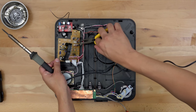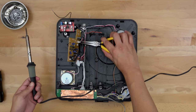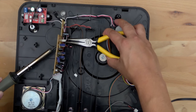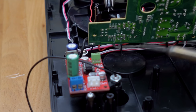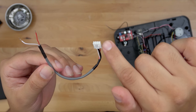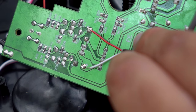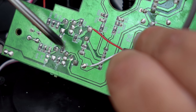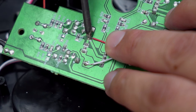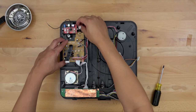Let me start with C18 — there's one. The second one is C8. What I'm doing is taking my needle nose pliers and holding the capacitor at one end, then heating up the other end so I can lightly pull it out. Now, provided in the box is a cable that goes into your preamp, but first we need to solder it to the board in place of those capacitors. Your white cable will solder in place of C8 and the red cable in place of C18.